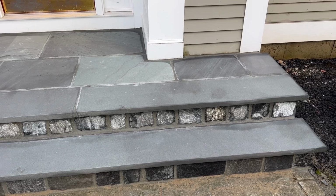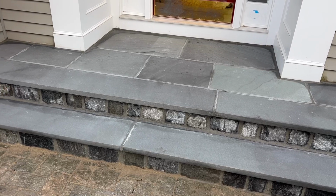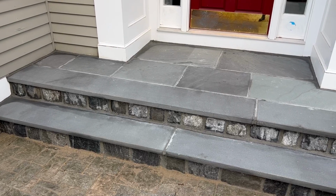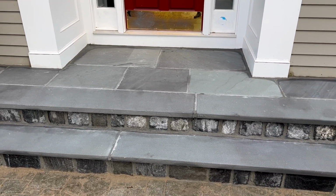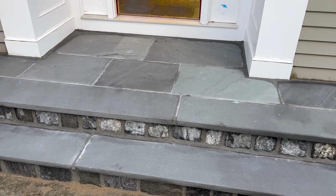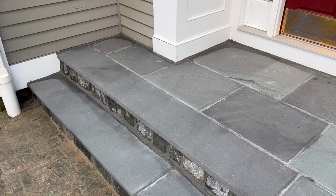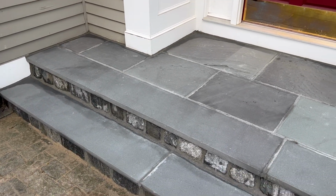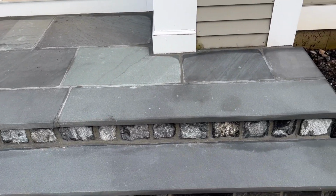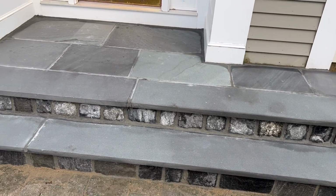So once they're satisfied with it, I told him I would strongly recommend sealing it with a water sealer, specifically for stone, a non-gloss one. That way, when you keep it clean, that'll prevent the water from absorbing into it like a sponge, and it'll make it last longer. So I don't personally seal them. I leave that up to the homeowner to seal it, or the masons. I just come in and do the repairs and the cleaning. But that's what the masons tell me to tell the homeowners. So that's what I tell them.